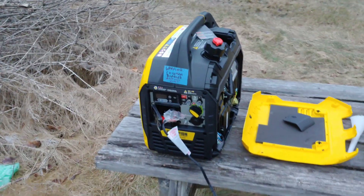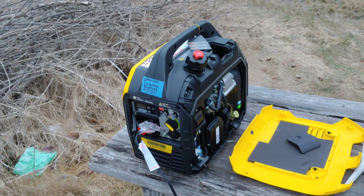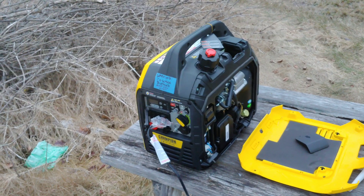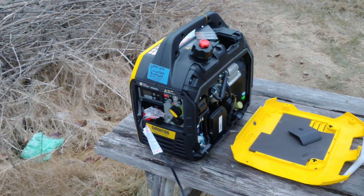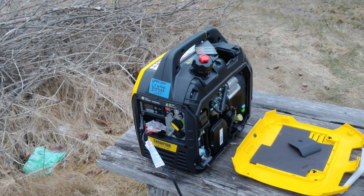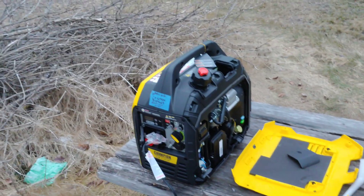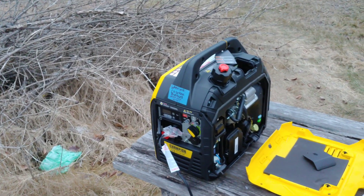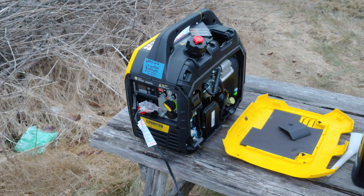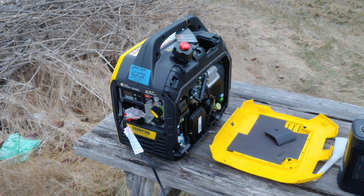So if you want to disable it — some people have trouble with it — I'll give you a warning: don't do it if you're afraid something's gonna happen, keep it there. But I've got mine set up 25 feet away from my cabin in a little shack. It gets a little bit of CO in that shack because it's got sides on it but the front and back are open, so if I'd left that sensor on it would have shut right off. I'll attach a video at the end showing it running in that little shack — the light was flashing but it stayed running. Anyway, that's it for this part, thanks for listening.